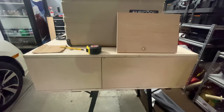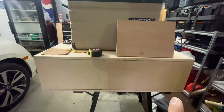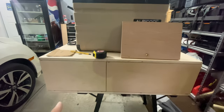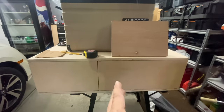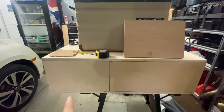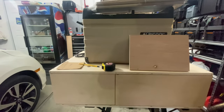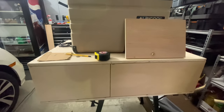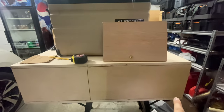Right now what I'm trying to do is line up my front drawers. This one is 39 inches long and this one is 16 and an eighth, so my center line is not centered because this drawer is obviously longer. I've got some dimes underneath and I'm just spacing them along the top here, because I'm getting ready to take a quick measurement for the locking portion that I have to cut out of the corner right here and right here.